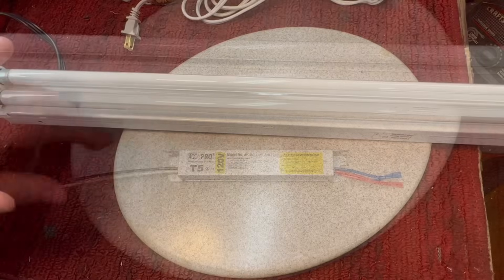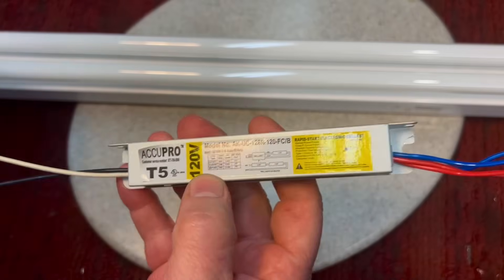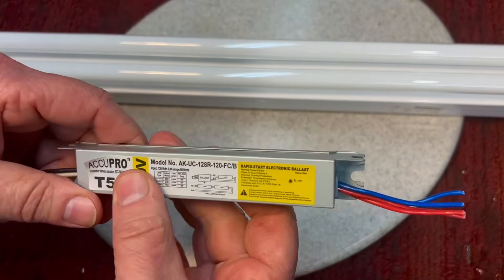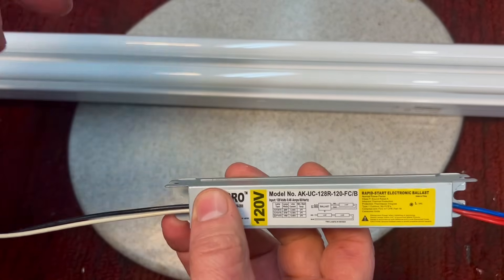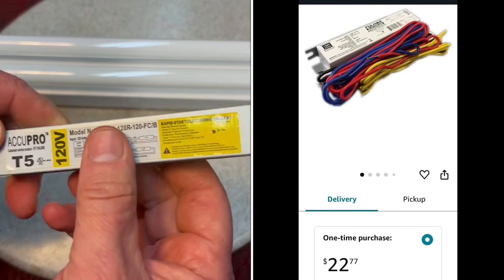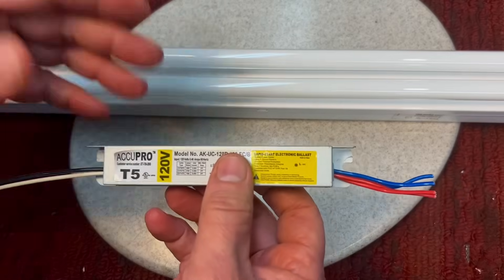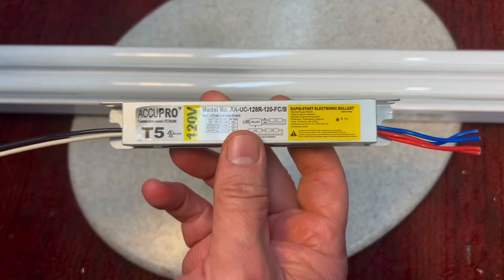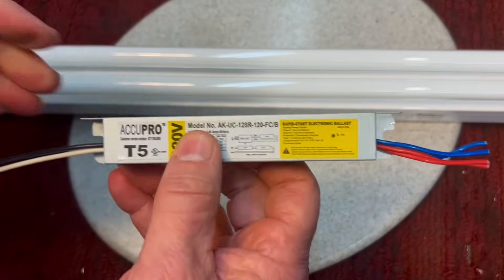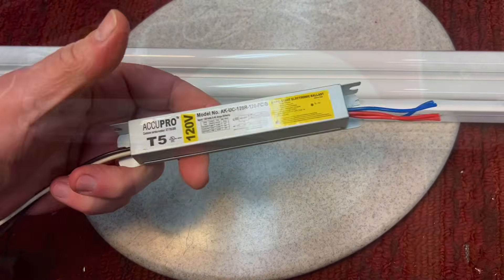Let me check the ballast. This is the ballast that was in there. I tried to check it — they're a little hard to check. It checked out, but it wasn't doing its job. The ballast was bad. So I ordered a ballast. I'm already in $6 for the bulbs, another $20 for the ballast — in $26. I could probably get a new fixture for $25, but that's being penny wise dollar foolish. I put the new ballast in and I was learning the whole time. I watched so many YouTube videos, I was reading up on fluorescence, I became totally engrossed in it. I wound up putting a new grounded cord on it anyway.